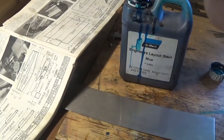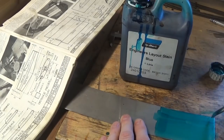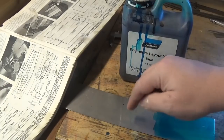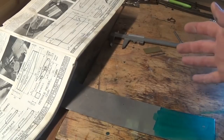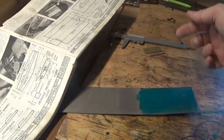Somewhere I have a decent paint brush, which is what I tend to use for layout because you don't get as many streaks. This is quite thin sheet, 0.6mm stainless. I think Kenneth has probably put it down as stainless for a couple of reasons — anything could probably do the job, a bit of ordinary steel or even brass would do it, but this will last longer because it's got a hole that runs through it with a bolt. Brass is just going to wear out pretty quick. It could probably also be milled out of solid, but this is the easy and quick way to do it. We'll let that dry.